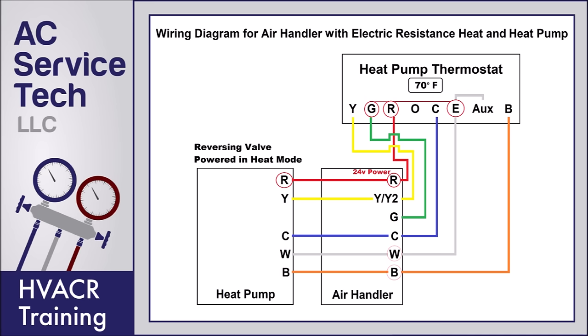If you turn the thermostat to emergency heat mode with a B terminal system, it's going to be the same wires being connected as in our first example when the heat pump thermostat was wired to the O terminal. And if you were to turn the fan on only at the heat pump thermostat — instead of heating or cooling — it's going to be the same as in the first example: you're just going to have 24 volts powered at the G terminal on the air handler.